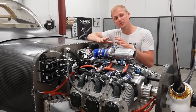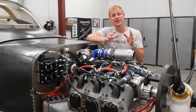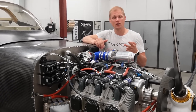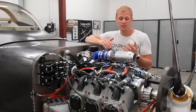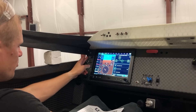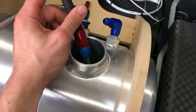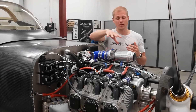There are a bunch of little tasks that we had to complete to get it all hooked up and ready to go. Some of the last items on the checklist were priming the fuel system and priming the oil lubrication system. The way we primed the fuel system, we basically just turned on the fuel pumps — they're electric — just pumping fuel through the whole fuel system, all the plumbing. Then we're waiting to see that we have fuel returning back to the tank in the return line. So once we confirm that, we know we had fuel all the way up to the fuel injectors.